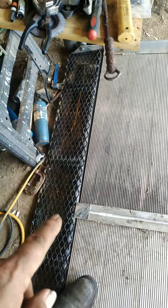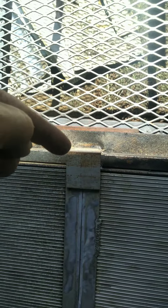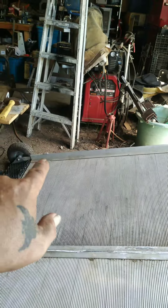Got that in place, all welded up. I put a tab here so it can't come out, welded across the bottom. I put a second tab here, welded across, up and up. Then I went and put four tabs on the sides — hook tabs clamped down and welded in place, one over there, one down there, one down here. Then I went underneath and put two bolts pinching them together. This thing is pretty solid.